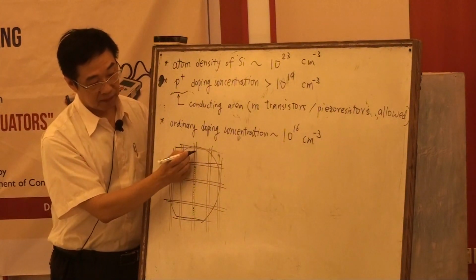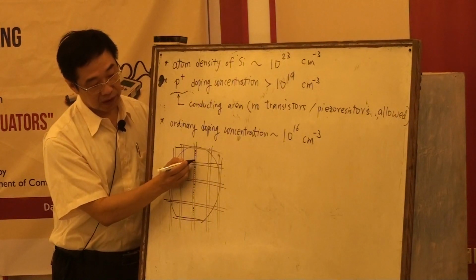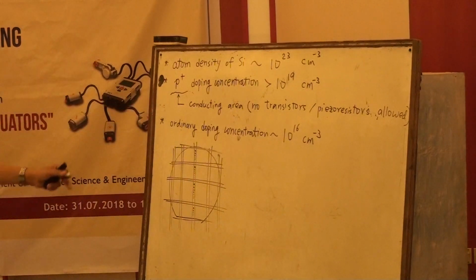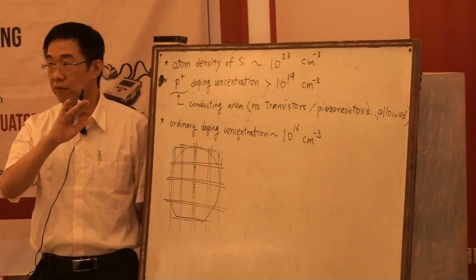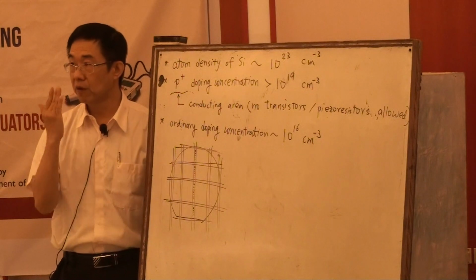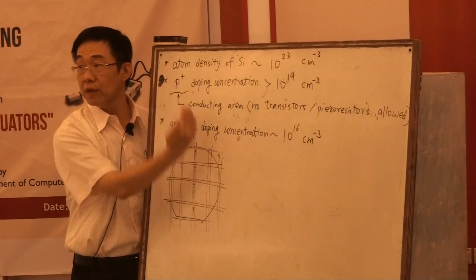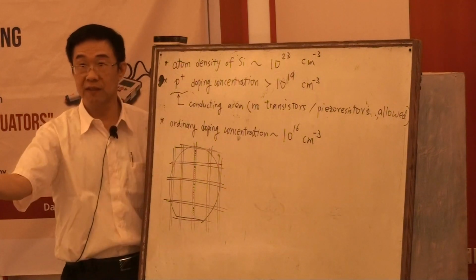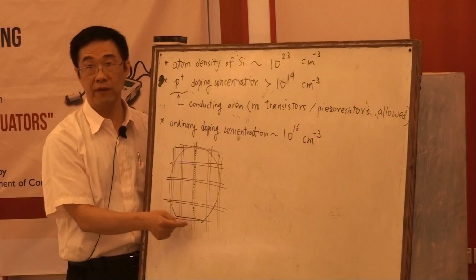We make a big groove from the bigger one to the smaller one. And this part will finally be of no use, because after the fabrication of the second wafer, we will use a dicing saw to separate our sensor chip for packaging. So this line will finally be sacrificed.